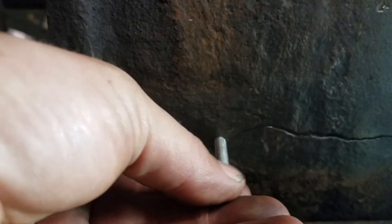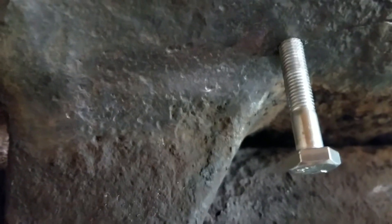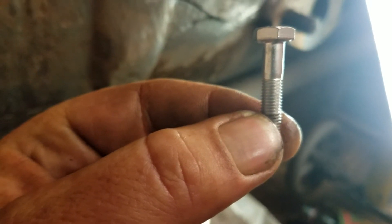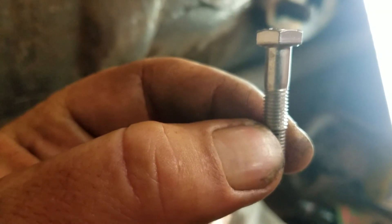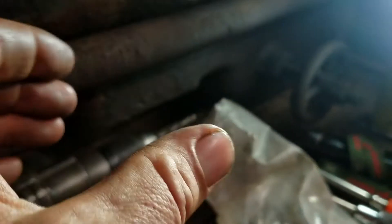So, this is the plan — it's already started. Start right there at the crack, close to the front of the crack. As you can see I drilled it, tapped it. I'll take these little bolts — these are quarter inch fine thread bolts. I drill it, I tap it, put some green loctite on it, and I tighten them up until it tightens up against that shoulder. There's a little bit of a taper there on the shoulder of that bolt. I'll probably cut some of that thread off because it doesn't need to be that long. You ram that in there until it's tight, and that taper will kind of pull that cast together as it tightens up.